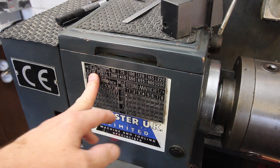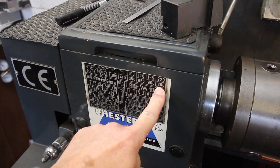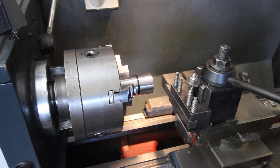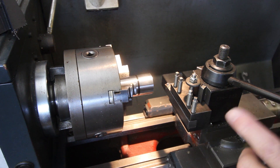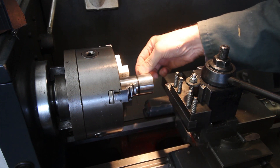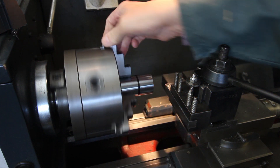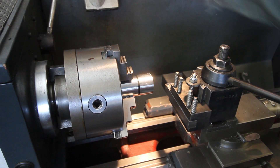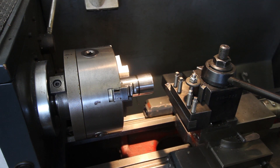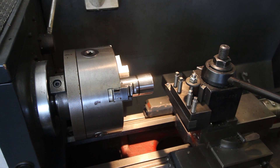Sorry about the aeroplane in the background, but I've got the lathe set to its fastest speed which is 1200 RPM. This bar is actually old hydraulic ram stock that came out of a skip from a hydraulic company near here, and because it's chrome plated the first pass will be to get under the chrome — so let me just do that and I'll show you what I mean about how brutal this thing is.